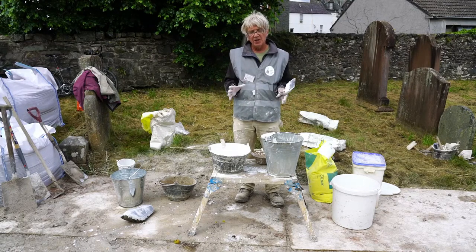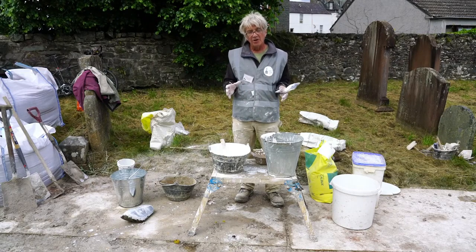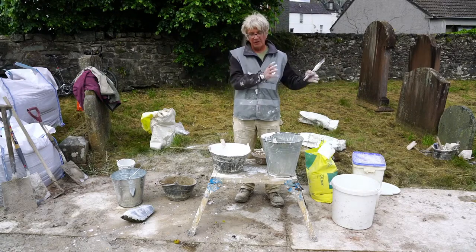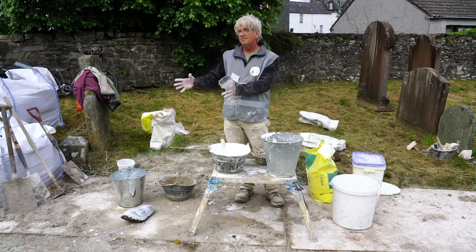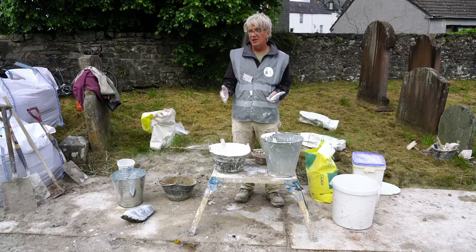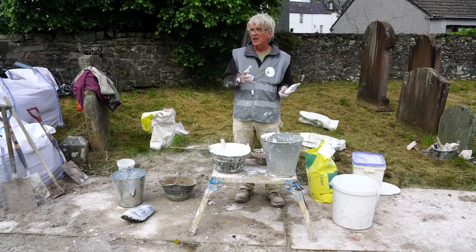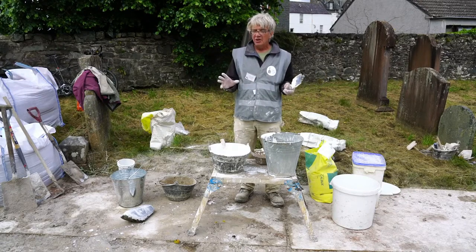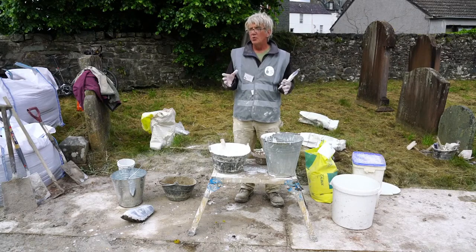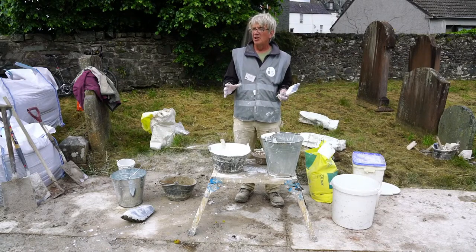The last piece of really relevant research is from the Technical University in Portugal, who've done a lot of really good research into vernacular materials and practice, more than any other university department really. They tested lime wash on the least porous to the most porous substrate. Their hypothesis was that coats of lime wash inhibited the drying of the building. So they were clearly gobsmacked to discover that no matter how porous or how little porous the substrate, the fabric of that structure dried more efficiently, faster, and to greater depth with a coat of lime wash than without a coat of lime wash.